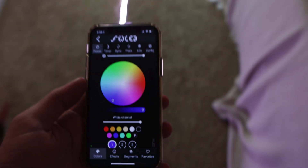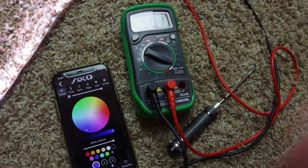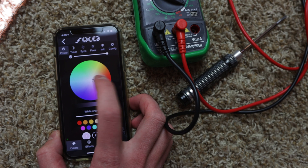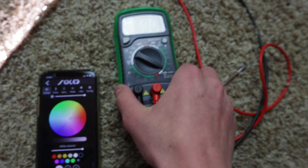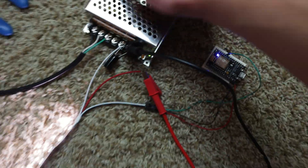This app is great — you can configure a bunch of stuff in it. I have a multimeter hooked up to see how much power I'm drawing. When I turn the LEDs up on the white channel all the way to pure white so they draw the most power possible, this is basically as bright as they'll ever get, and it's pretty bright. You can see that discoloration at the end — that's because this power supply is trying to run all of these and can't power all of them all the way to the end. I'm going to have to inject power in the middle and maybe at the end to fix that. But we're drawing about 6 amps of our 30-amp power supply, so we should be plenty fine.